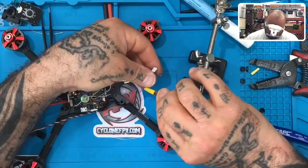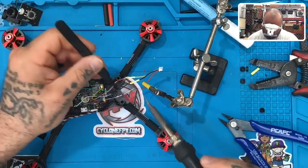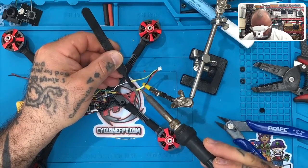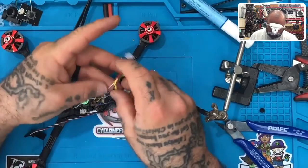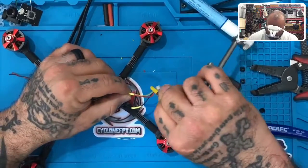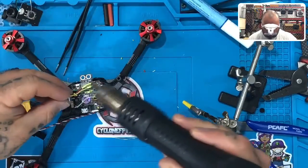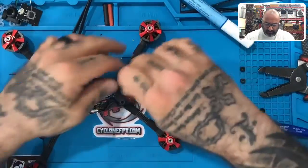The last one is going to be the red wire. Line that up, take the soldering iron, put some solder on it, put a little extra solder right there, then slide the heat shrink down the red wire and bring the red wire in — perfect. Now we have this last piece to get the heat shrink on. Get the heat gun again. Lift it up and get both sides, and you're done. You now have a very successful, strong, and reliable connection for your camera.